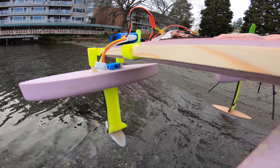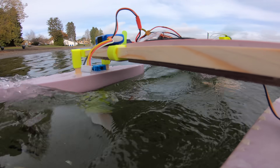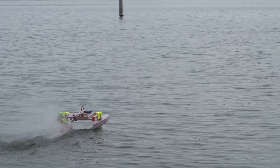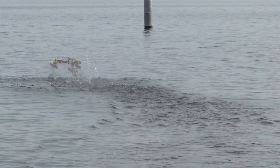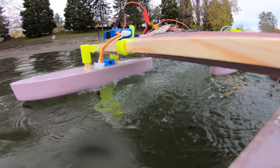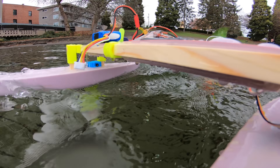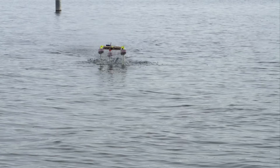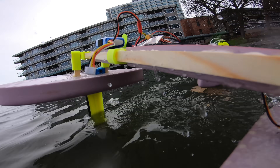The first thing I realized is that I did not put enough thought into the pontoon design. I should have made them with steps, like airplane floats, so that they can get up on plane easier. Instead, they are shaped like displacement hulls, which makes it harder to get up off the water. The next problem is that the motor in the back was sucking in a lot of water, which turned out to be a big problem as you'll see soon. Once I got it up off the water, it was almost impossible to keep at the right altitude without the hydrofoils just breaching the surface and skimming on the top of the water. There's a very small range of acceptable height to be at, and it's tough to keep it there.